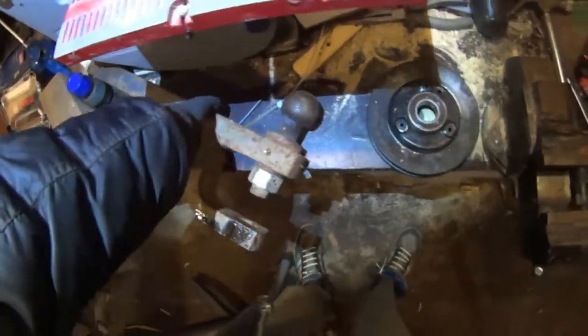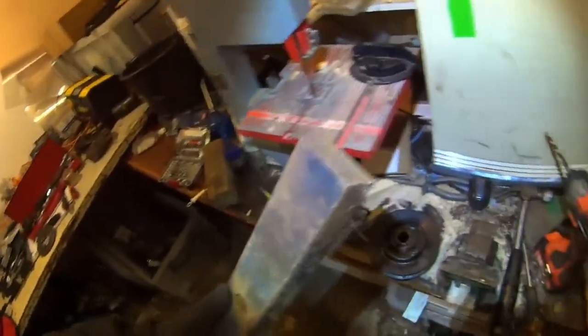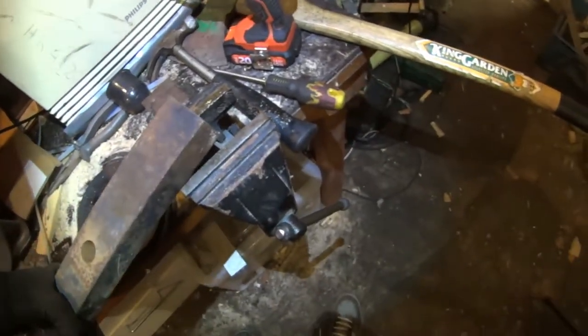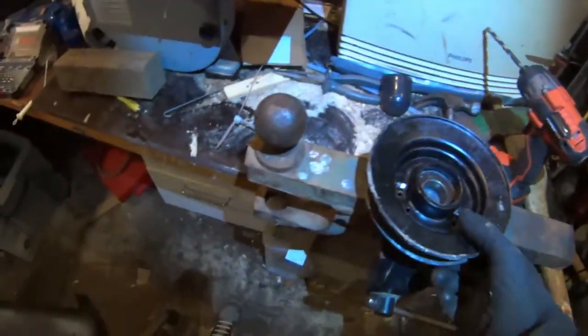The metal steel parts over here — I think that will deform again. Need something thicker. I found some tractor parts here — this is massive steel, it's never gonna deform. So we're going to use the opposite: clamp this into place, bring the pulley upside down, a big block of wood, and then hammer it back into location. This should be doable.